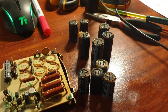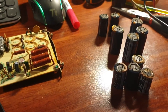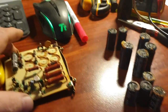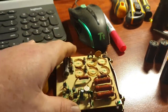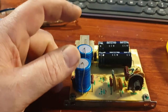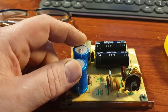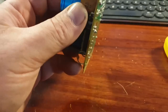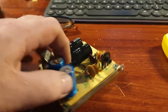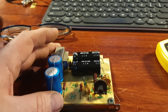It's really difficult to test capacitors in circuit — often you'll get situations where some of them are paralleled up or just seeing other components. With these rectifier boards, please don't worry about these two here — I'm doing a little proof of concept. We would never use these in a full-time installation. I've got a few of these 350 volt 22 or 20 microfarad caps sitting around, and I want to put four of those in there and just see if the board comes up and running.